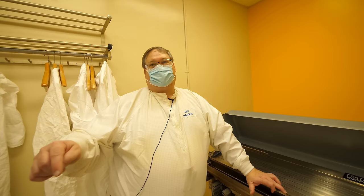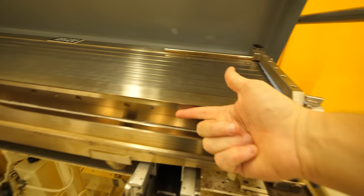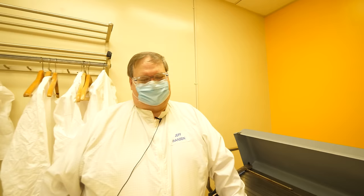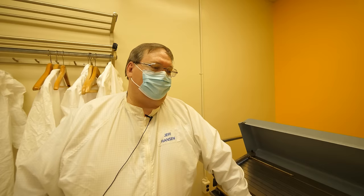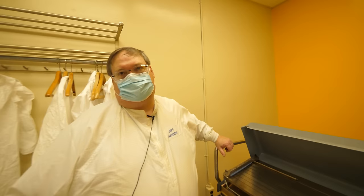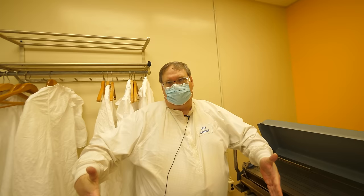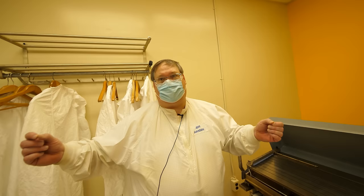It isn't just a liquid-solid interaction at the bottom — this flows over the edge and falls, so you have an air-water boundary on one side of the curtain and an air-water on the other. It's a laminar waterfall with a pocket of air behind it. How do you control the air behind it? There's actually a little vacuum. When there are issues with coating, they'll play with the vacuum conditions. The water edge guides — those wires down the side — help maintain the curtain as it falls. So you have guided laminar flow. If the edge guide wasn't there, it would neck in because gravity and surface tension would do that. By pinning it to the outside using that little wire with water on it, surface tension holds the width.